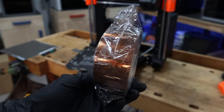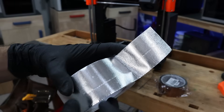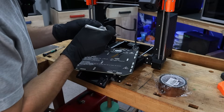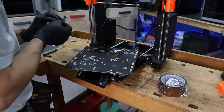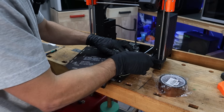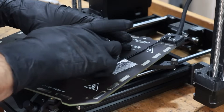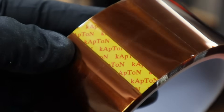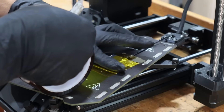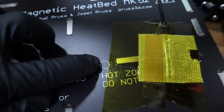I bought new Kapton tape and aluminum tape from Amazon — both capable of handling far higher temperatures than we'll ever get on the bottom of this heat bed. To remove the old thermistor I heated the bed to 100 then turned off the printer so the adhesive came away pretty easily. I moved it further from the center so it should read more accurately, covered it with aluminum tape and a layer of Kapton tape just like the original. Another option is to manually adjust the temperature in the filament settings or the configuration file.